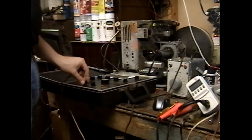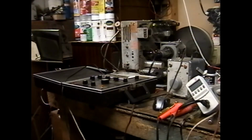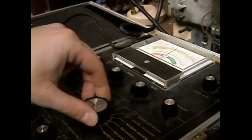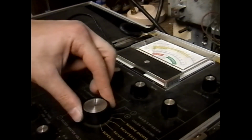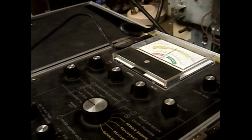Let's set up the picture tube. Let me try to get you an eagle's eye view of what I'm doing here. So we just set the filament voltage on the tube. And HK leakage is off the charts. So this is the tube that has the HK short. Great. Well, time for a bag of breakers.